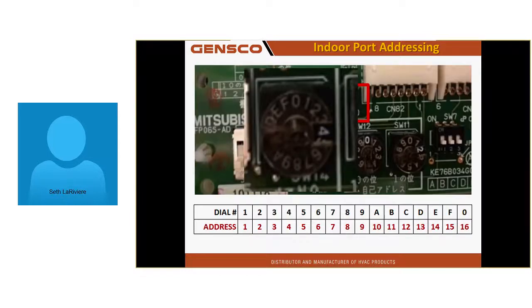I had a guy who did a job with 250 units, 7 central controllers. He did every unit with exactly the same address. So I had duplicate addresses on 3 or 4 systems per central controller. He had to go back and readdress the entire building by himself. It took a month getting access, dealing with all the problems, and getting it done right.